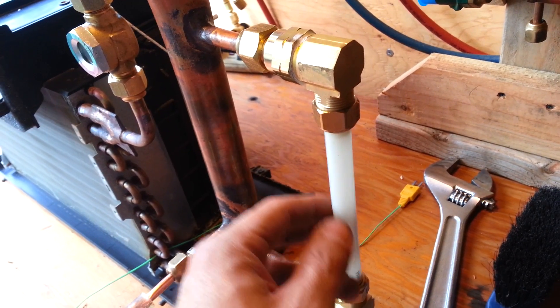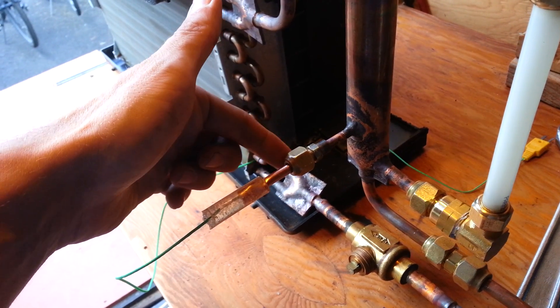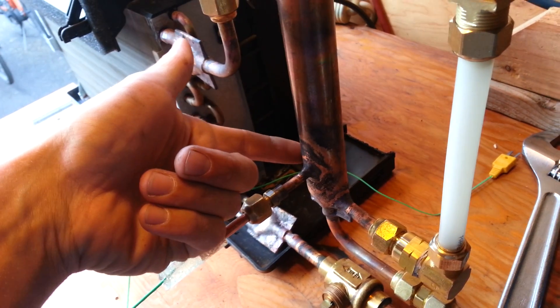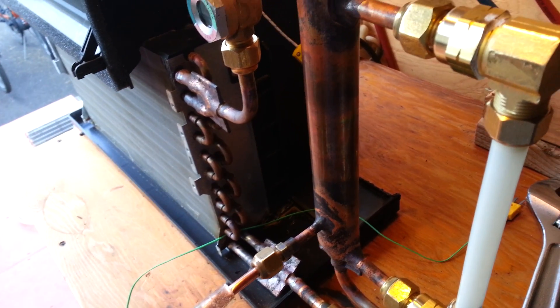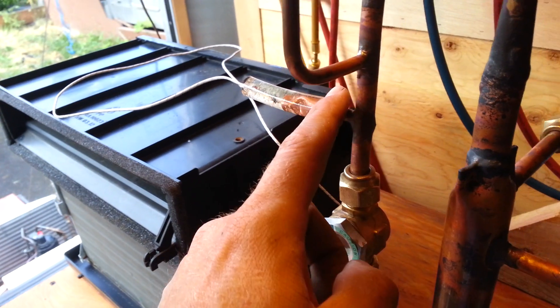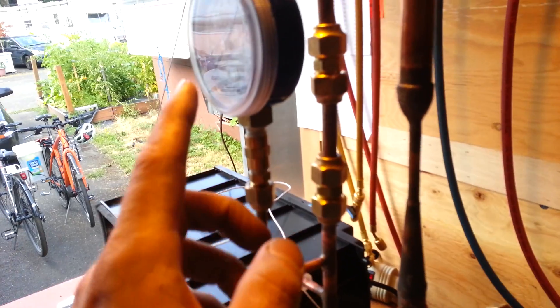The sight glass is a piece of half inch outside diameter nylon rated at 250 pounds per square inch working pressure. This is a thermocouple installed directly in the refrigerant line — there are some videos on making those. This one sits right out in the liquid in the separator to get a temperature on the separator column. The pressure reading for that is actually going to be taken from the gauges at the suction on the compressor, which is a rotary type. I can also take a temperature reading and a pressure reading from the suction gas of the evaporator.